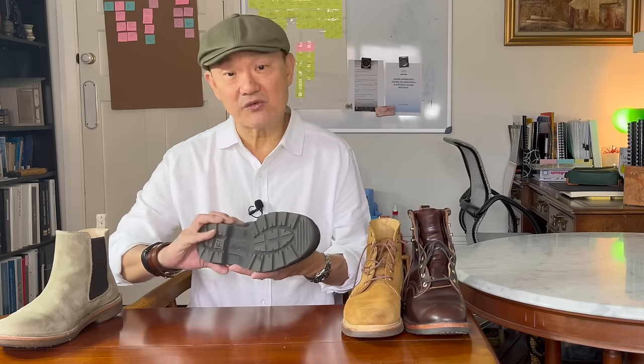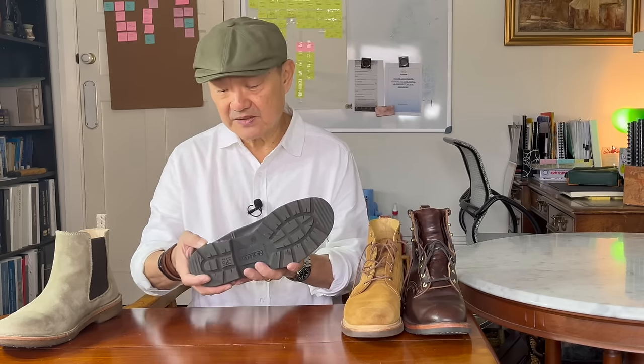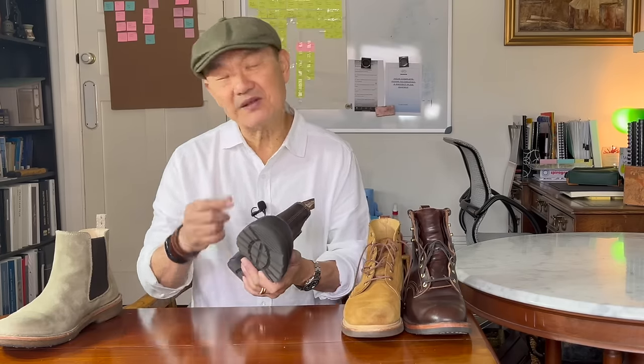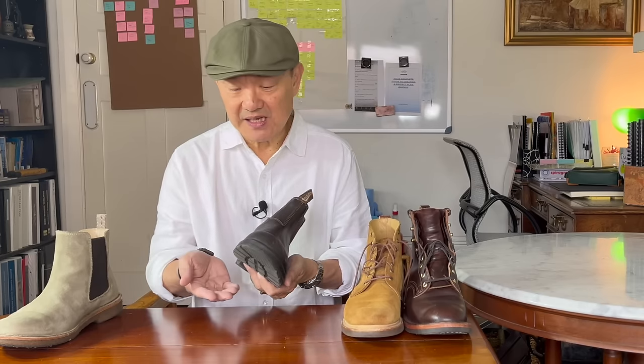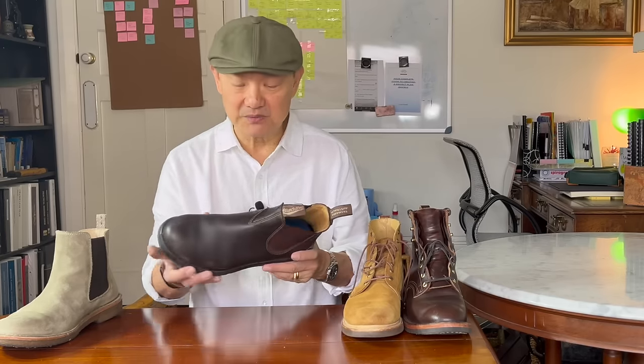Here's a variation. This is not rubber but it looks like rubber — it's a polymer, TPU and PU, polyurethane. On different mixtures it has either a firmness for durability or a softness for shock absorption. TPU is more often than not a cement construction boot. These are a pair of Blundstones — they're a little bit better than cement construction; they're actually heat molded onto the boot. In the factory, a molten piece of PU is tubed onto a mold, squashed in, and as it cools it sticks to the boot. Remarkably waterproof, as long as the leather itself is waterproof, because there are no stitches.